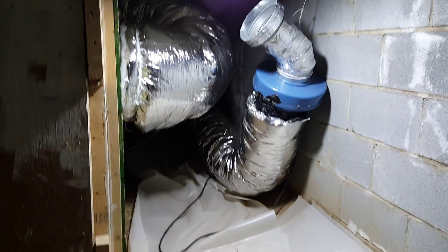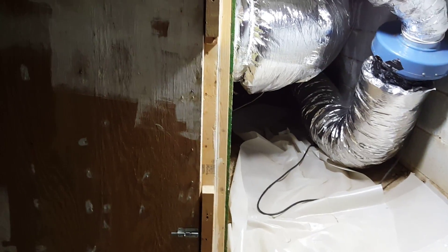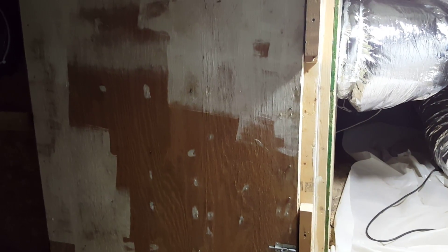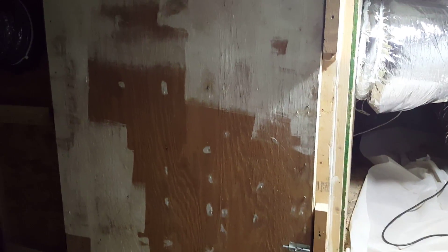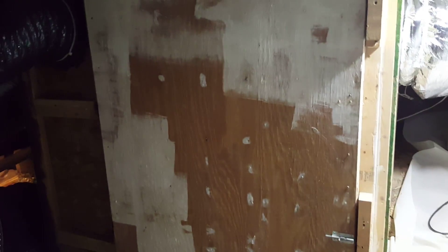I was running about 11 to 11.5 amps per Antminer S7. When I upgraded to 240V as a test to see if it would reduce power consumption or amperage, it did seem to reduce it a little bit — I believe because of the efficiency increase in the power supplies, going from 94% to 96%+ efficiency using 240V. The savings could be roughly $200 a year on four Antminer S7s, running 24/7.